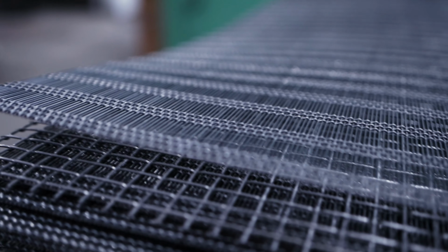The continuous annealing process is a heat treatment technique that calls for the unrolling of the wire mesh roll and running it through a furnace as a single layer. So to ensure the wire mesh is effectively treated, the mesh is typically run through several times, depending on your requirements, of course.